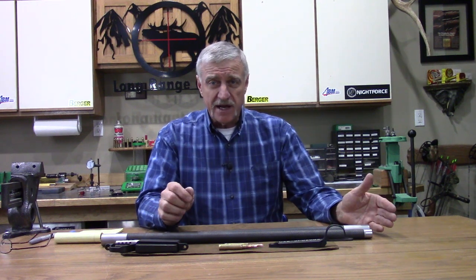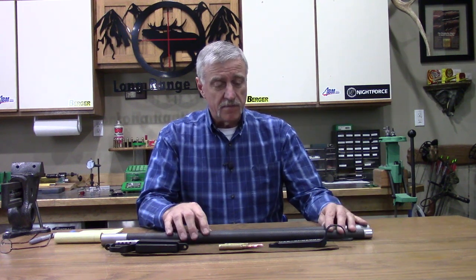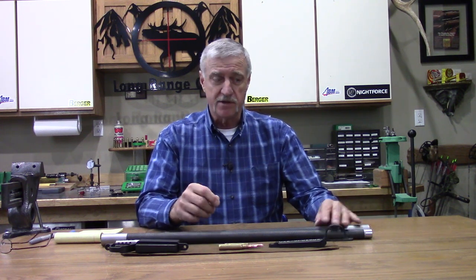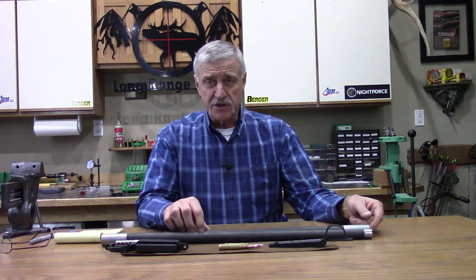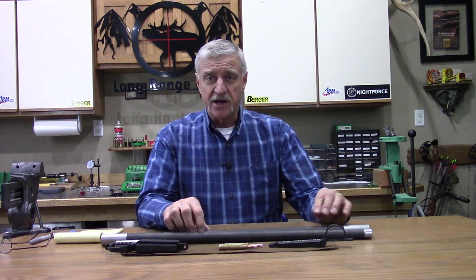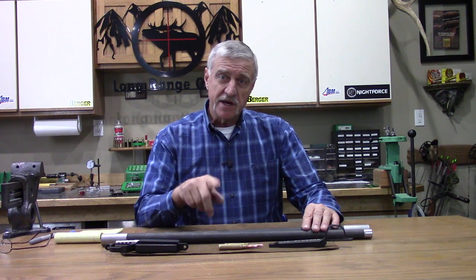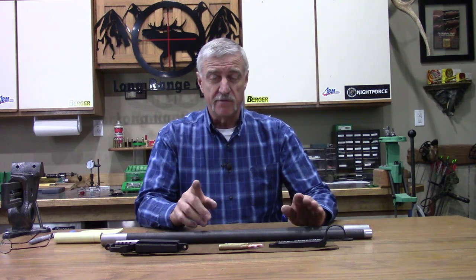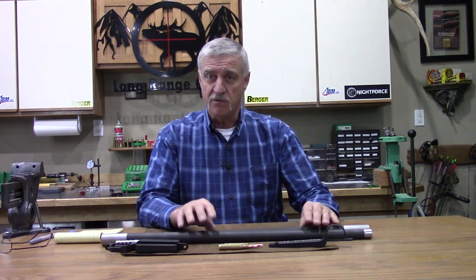To give you a little more about how I checked the twist rate: I used a tight-fitting bore brush and extracted it back out of the bore so I could measure from a start line. I put a start line right at the shank of the barrel, an index line on top, then pulled it out until I got one complete revolution, stopped there, and measured from that line back to where I started at the shank. One revolution equals 9 inches — that's a 1-in-9 twist.